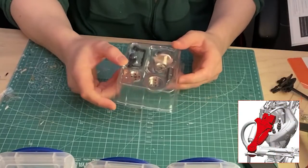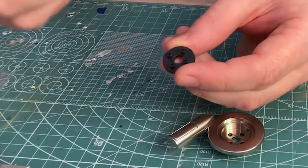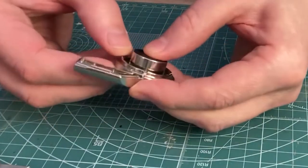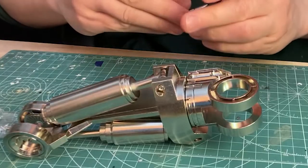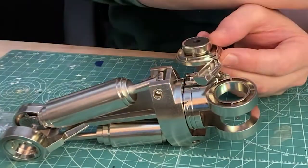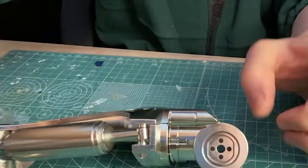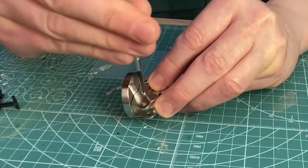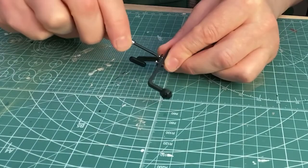For stage 7 we get more components for the upper arm and the head motor. Begin by taking the upper arm ring — the black piece — and applying a little super glue, then attach it to the main piece. Bring back the arm and fit that piece onto it. Now take the upper arm parts and join together with 2mm screws. Take the 2 motor joint pieces and secure together with 2 six millimetre screws.